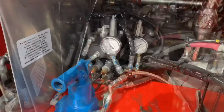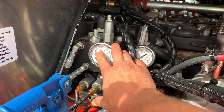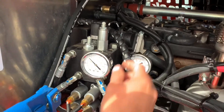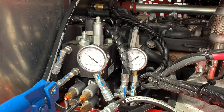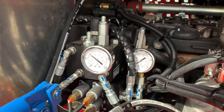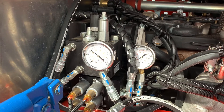With the engine running, I was able to adjust the pressure so the working range is sitting at around 800 psi, and the unloader will vary between 800 and 600 psi as it kicks on and off to provide pressure to the valve. I tightened up the relief valve about half a turn past the setting where I could see it was actually reducing pressure — that gets the setting set properly. If you set it wrong with the relief valve lower than the unloader valve, it just builds heat, and heat and robbing horsepower are enemies of any hydraulic system.